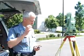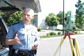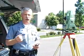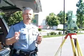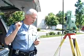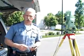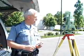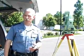First off, with me having a 0 point here and a 50 feet point there, I can go into court and identify to the court that there's an exact measurement taken not only by tape measure but by the unit, and it correlates to each other, which helps correlate all the measurements within your diagram and makes it more acceptable for the courts to take. It also makes it less of an error value when you get into court and start talking about different issues, say with speeds or measurements or distances. So it's very important that you have that second reference point identified so you can come back later and set up on it.